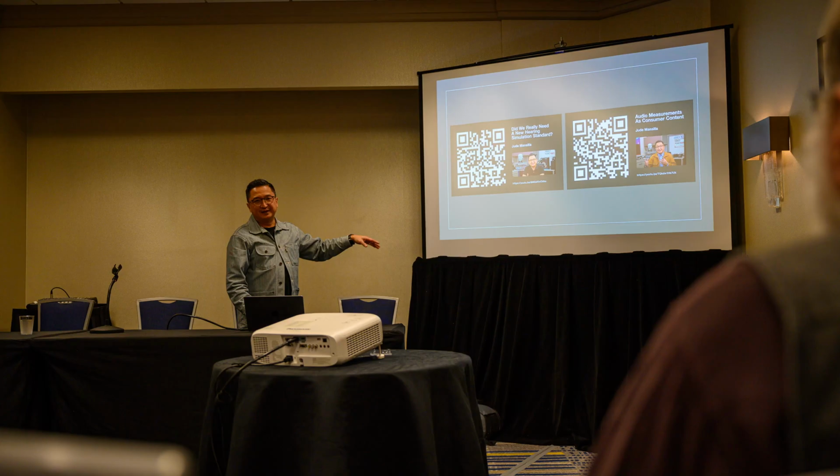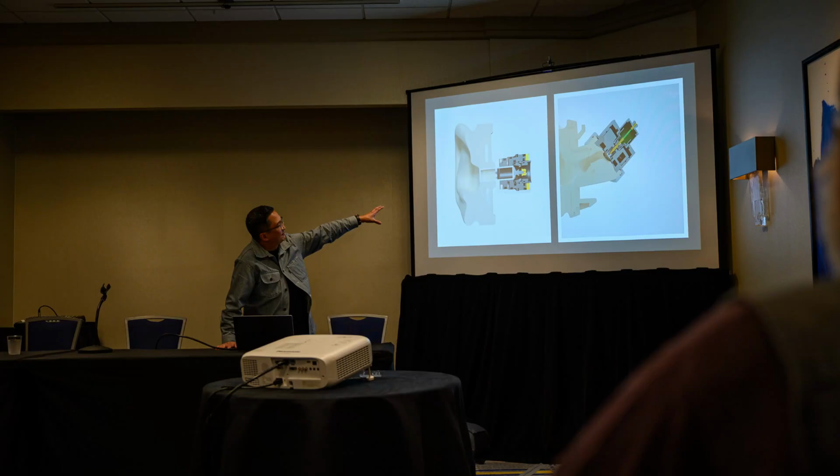This is a typical 711 mannequin configuration here. And that is the new standard that we're using at the office. That's the Type 5128 from Brüel & Kjær. And you can see it's much more human-like. The typical 711 here is a 7.5 millimeter by 22 millimeter tube with an equivalent volume of 1.26 cubic centimeters. That's going to matter in a minute. The 5128 is a 27 millimeter-ish long average human ear canal with an equivalent volume around 1.55 cubic centimeters.